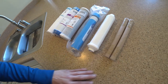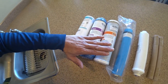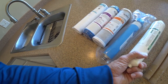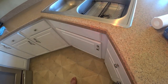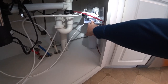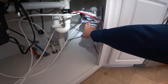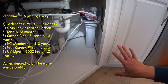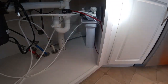There's no light underneath the cartridge when it goes out. I recommend replacing the first three every six months to one year, and the RO membrane and post carbon filter every one to two years. Today I'm going to replace the system — the first three filters have been about eight months, and the RO membrane and post carbon have been over a year, so I'm replacing those today too. I'm going to show you how — super easy, real simple — the easiest and cleanest way possible.